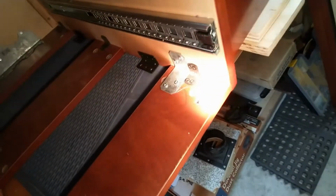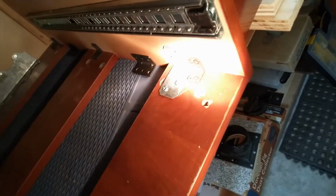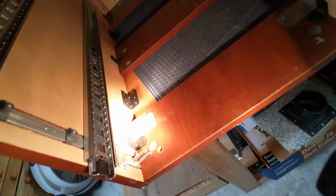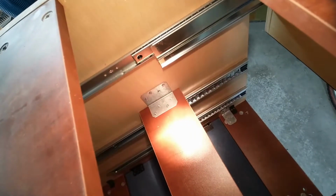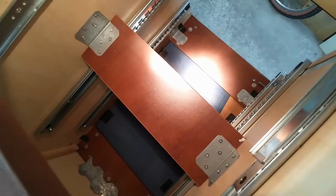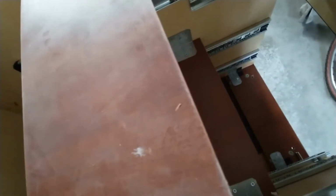And then what I did on the inside, you can kind of see here, it had the smaller black corner braces already, so I added the silver ones. So I added a big one in the back, smaller one on each side, and then this also had a built-in cross brace to help it from racking, which is one of the reasons why it was solid. So I added another brace on each side there. So that should make this part nice and solid.